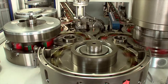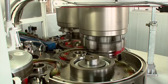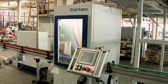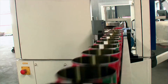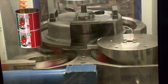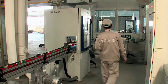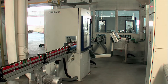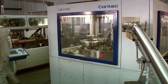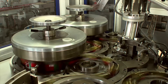The shown 210g tomato paste cans are non-necked and non-beaded. Kantec's parting without pre-flange makes the difference. Double high-welded bodies with score line, after parting without pre-flange, can be die-necked at both ends like single high-welded bodies. All types of ends — standard ends, steel or aluminium easy-open ends, or peel-off ends — can be seamed on with standard midi or mini seams.